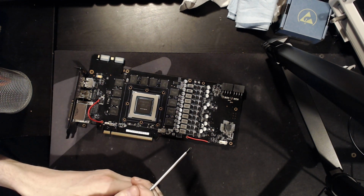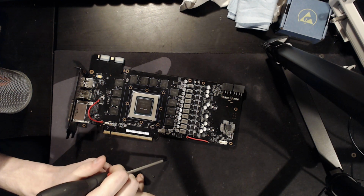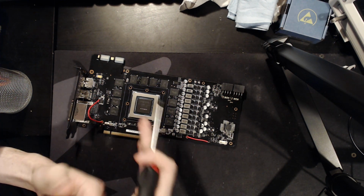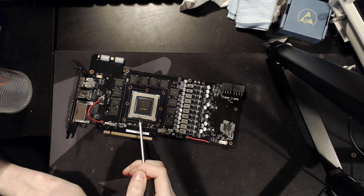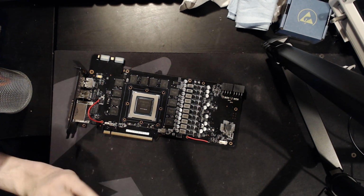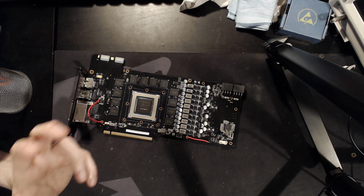And also the reflow temperature for lead-free solder, which is what you have on all of your GPUs, is 217 to 227 degrees. So yeah, you're not reflowing in an oven at 180. But if the card starts working, it basically means that you've managed to thermal shock the contacts on the silicon back into alignment with the contacts on the substrate. And it might work for the next hour, or it might work for the next year or several years. It really varies. It's random chance that the core died, and random chance that now it works again, so it's random chance when it'll die again.